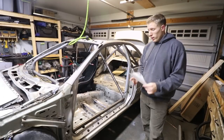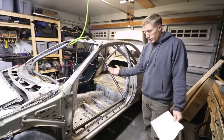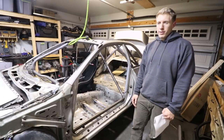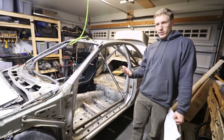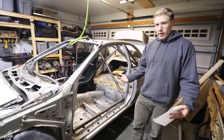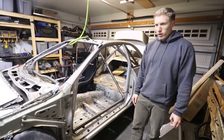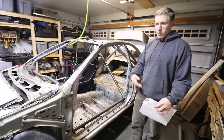Your next option is one straight bar over the top and then a V or U of one continuous bar coming down and back up to meet that bar. I don't think I've ever actually seen that in a car — it's kind of a weird design, but it's probably out there. The benefit is you don't have to gusset it, so there's less gusseting involved, less work. If you're trying to build the safest cage, gusseting really isn't that big of a deal.